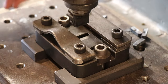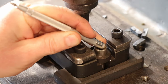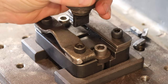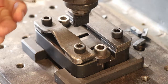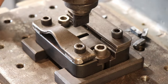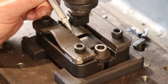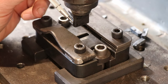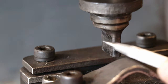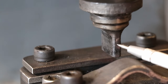It's held to the plate by two three-eighths bolts with washers, and I have enough play that I can line it up perfectly with the punch. I probably have a hundred or maybe two hundred punches through this and there is very minimal wear — it's a little shiny. On the left side I didn't line it up quite right and I have a little bit of damage there, but not too bad. The punch is in similarly good condition — it was made on my lathe and then milled in my CNC mill.